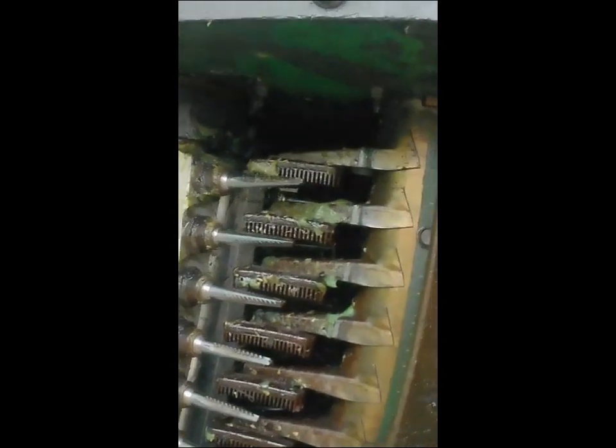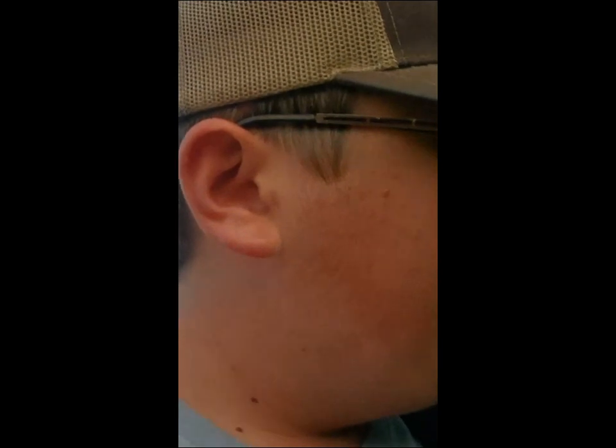But here is the trap door. Oh, look at there, you got another set of spindles. And moisture pads, that's your moisture pads. That's what keeps your spindles moist, because if your spindles ain't moist, they'll start wrapping. And you really don't want it to wrap right here around the nut. That's called nut wrap, and it's aggravating to get off. You gotta either go through there with a knife and just scrape it off. It's not fun. And then there's your other set of doffers.